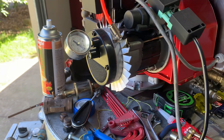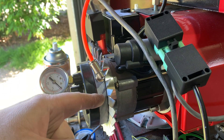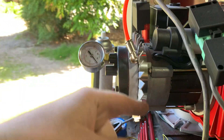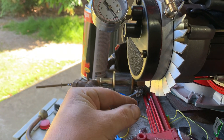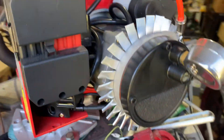The other alternative we've been looking at is to wrap two or three turns of copper tube around the pump. Basically, where the oil goes into the tank, you'd run your tube around — that braided line would go on here onto a fitting, around the pump, and then into the tank — so you're sort of preheating your oil a little bit as well. That's the other alternative; I haven't tried that experiment yet.